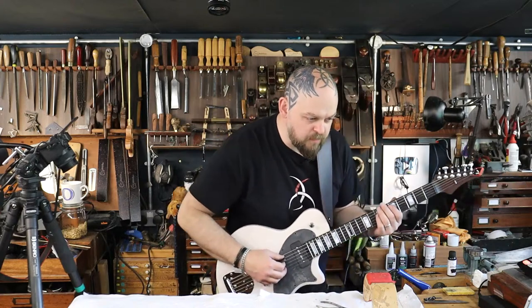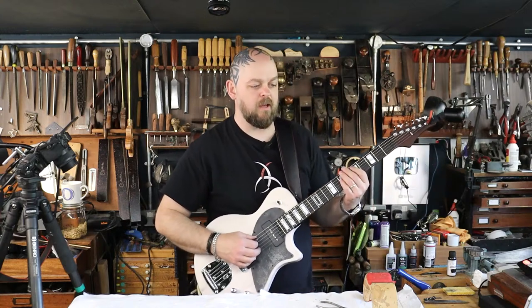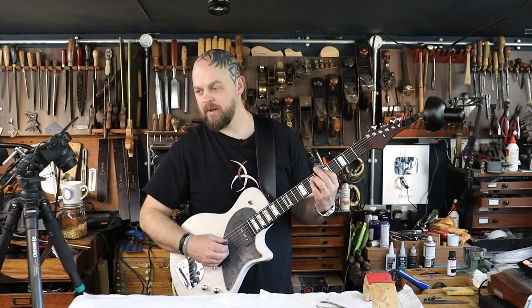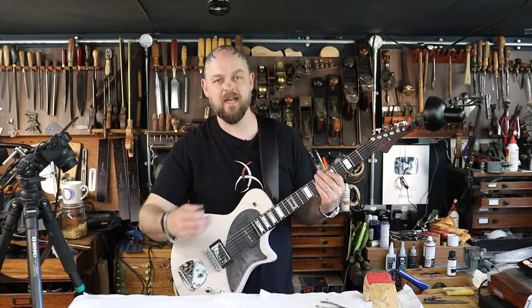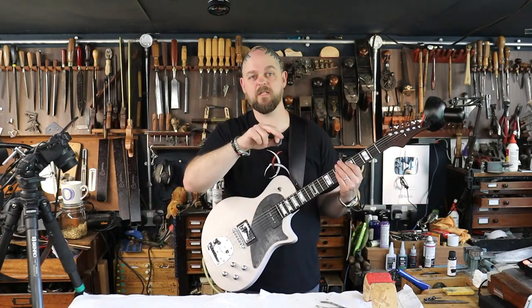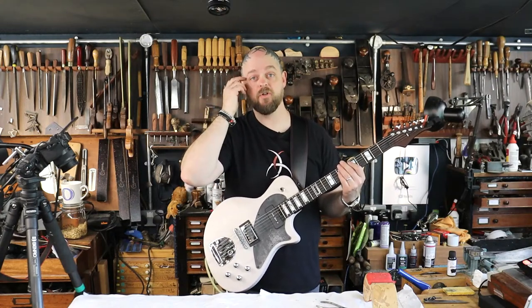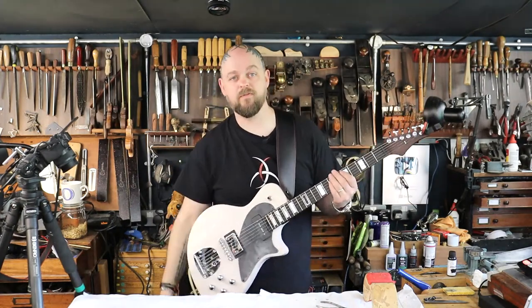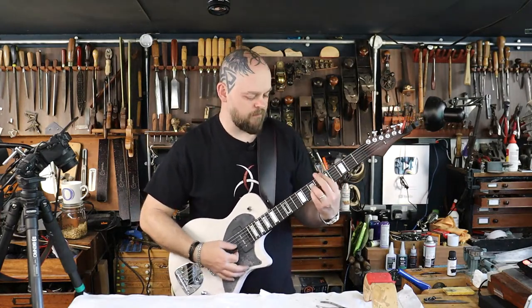Paul Neat says, Ben, could you please remind me of where the first lines are drawn when doing a facet neck carve? It's basically midway between your center line and the edge of the neck, and then halfway down, but it depends on what curve you want. The best bet is to draw the curve you want in cross-section, draw a rectangle around that, and then you can work out the best way to facet it from there. It doesn't have to be a perfect C-shape or whatever.